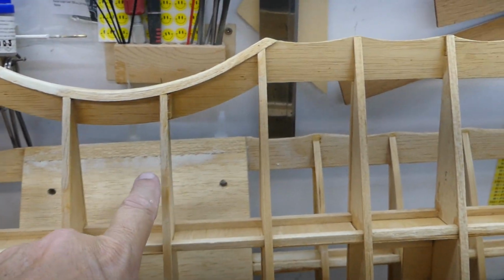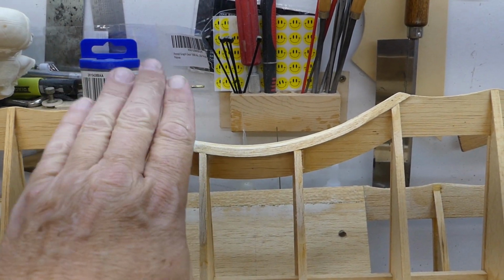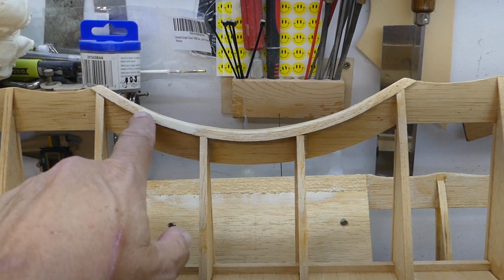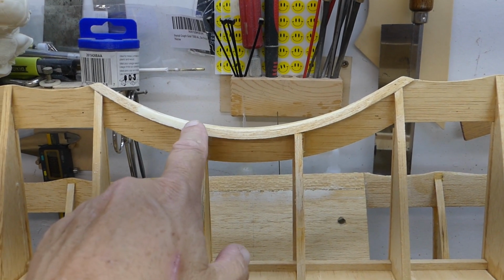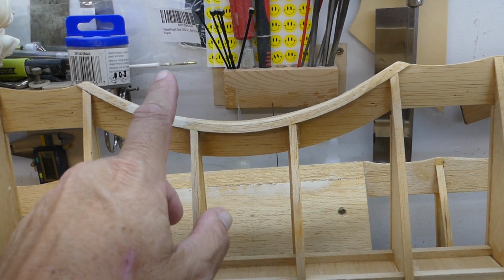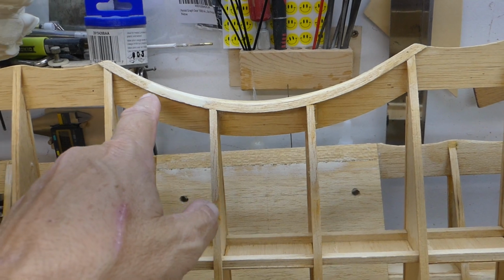These little rib caps have been fully replaced and taken care of. There was a little bit of a, I call them a wow. I still may need a little bit of a touch up. There's a little teeny dot right there. There was a little bit bad where the guy originally sanded it out. It was a low spot. So I just came in with some filler, filled that up, saturated with nitrate dope. So all of that is good. I may have to touch it up here a little bit, but not too bad.